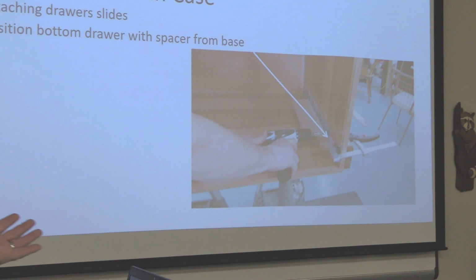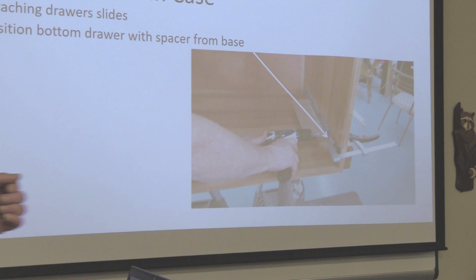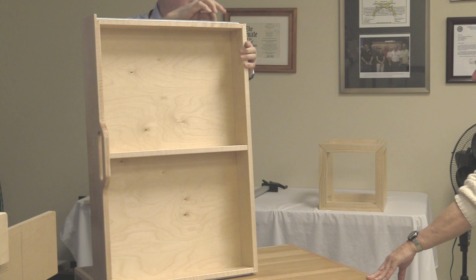We originally found out when we built the drawers, what Larry's talking about, that side was too thick because we put the drawer in there, and then I took the drawer slide and just stuck it down on either side. I said, that's kind of tight. Then we decided we're going to have to plane it. No matter how many times you measure, it doesn't take much with the drawer to be off. So when I plane this drawer side, the back is now extended beyond the side, so this piece had to be cut back down too.